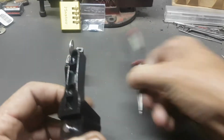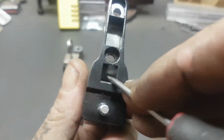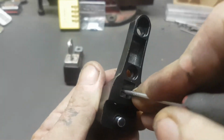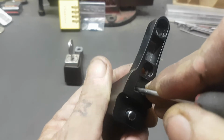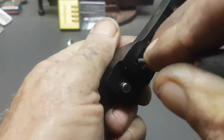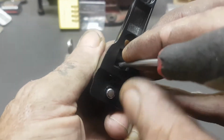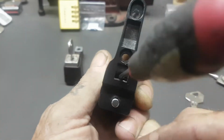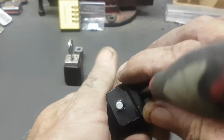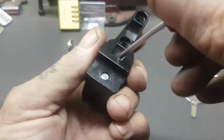So what you need to do is bypass it completely. So get a flat screwdriver, a small one, get behind the latch, and push the screwdriver right back. You'll feel when you're right back, it will get solid, like so. Once you've done that, you need to just depress the latch fully down into the body, which will give you access.